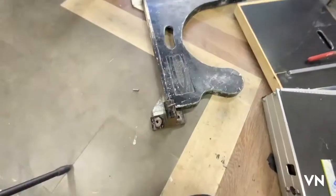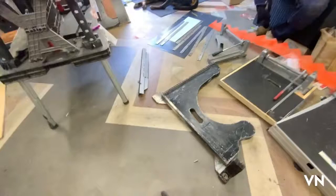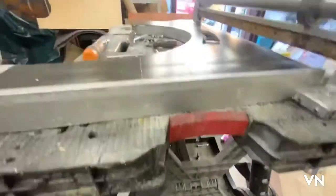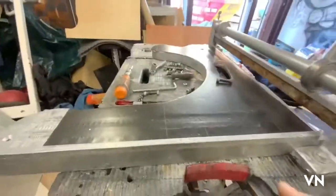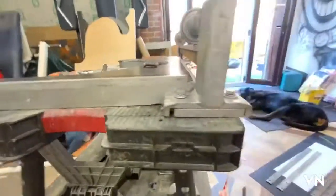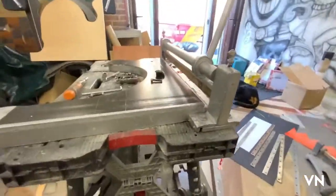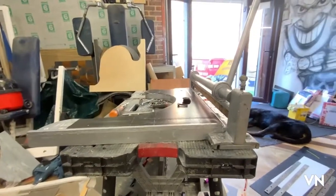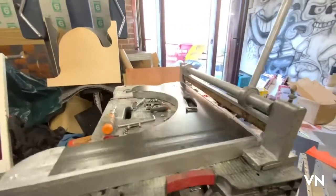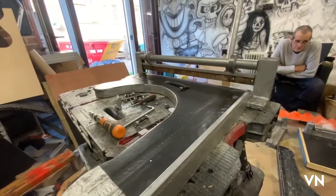So you've got wriggle room for adjustment when you put these on. It's a big heavy machine, so over time the knocking can either loosen it or shift it, and what that will do is move these pillars in or outward. With the Allen bits at the bottom, I've never been able to adjust them — they're like painted in, so when they're factory set that's probably it. But we'll get the new blade on and then put it on the floor and show you how to adjust it if it's rocking.